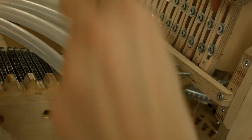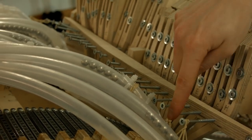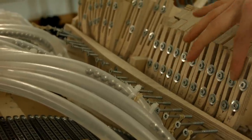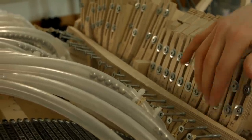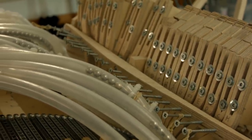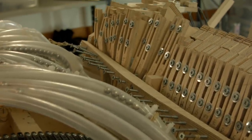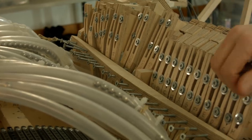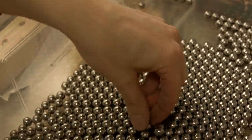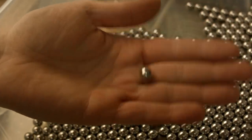And you will see that it moves like that. The programming nail will hit this lifting finger later, and the C of the vibraphone will play a tad later, which will make the machine tight. There are 22 adjustment screws, just like there are 22 marble gates and 22 lifting fingers.